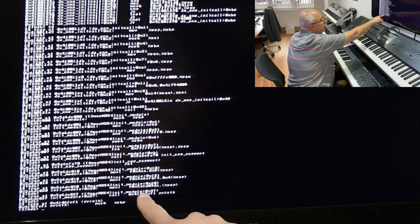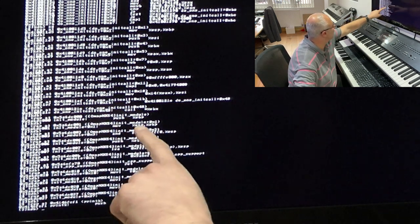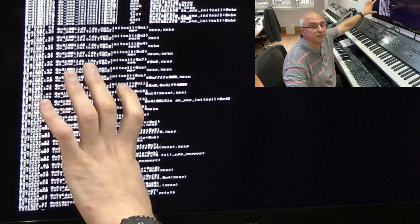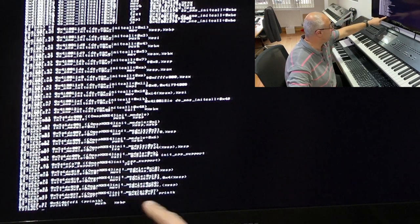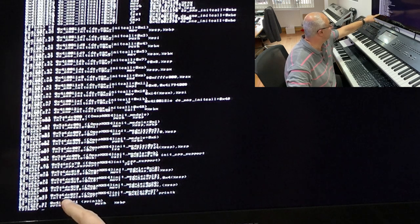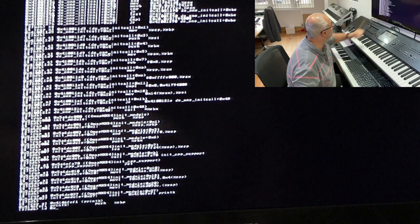Beg your pardon. Do one init call here, and then we kept tracing it, and then it called EBX, and then we jump into the init module. The init module is the bit that is actually the module itself. So now we are inside the module itself. I don't want to trace the printk call, so I'm going to put a breakpoint and exit it. So now we need to look into the module itself. So now if I do ID, and I'm going to look into init module.